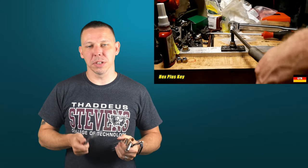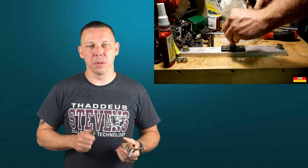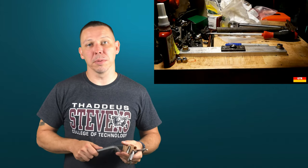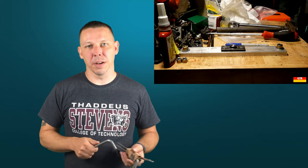You should have safety glasses on anyway, but it's not safe and you don't want to ruin your tools. And if you're putting that much torque on a fastener, there's a good chance you can break the fastener too. There's really no good outcome — the good outcome would be you'd get the stuck piece of hardware out, but there's a dozen bad outcomes and one possible good outcome. So we're not going to add anything to the end of this wrench.